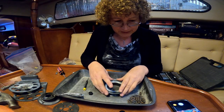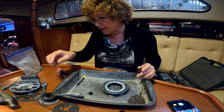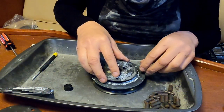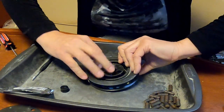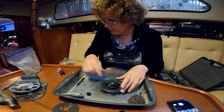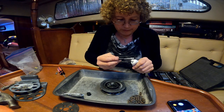Okay, we've got 50 in here. Counted them all out and set to 10. And I'm going to drop in the lower plate, which will allow me to flip the entire unit carefully over. Okay, and now what we can do is grease the inner ring for the rollers.